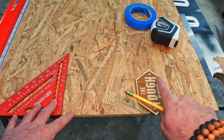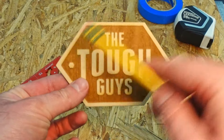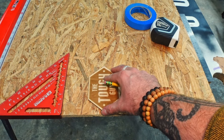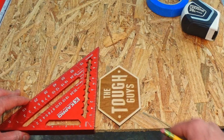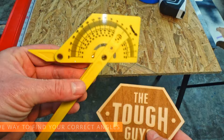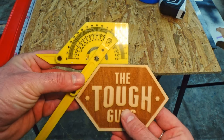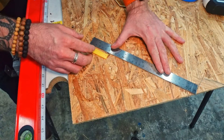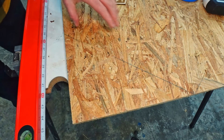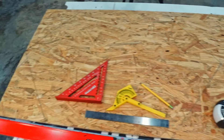To get the correct angle there are probably many ways to do this, but since I already have this one made in exactly the shape we're going for, I'm going to use it to create the angles. I'll line up the centerline and use a speed square up against the edge of the plywood to mark these two lines. It's not quite 50 degrees but I can use this to help create the correct angle on the wood. Then I take a straight edge, mark across, make sure the cut is correct, and repeat this four times for all four corners. We have the shape marked.